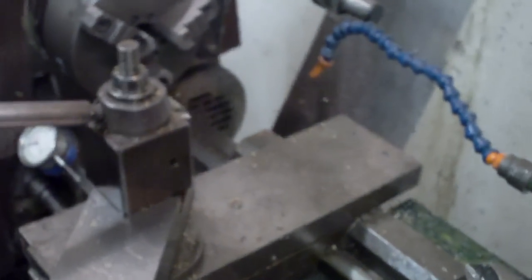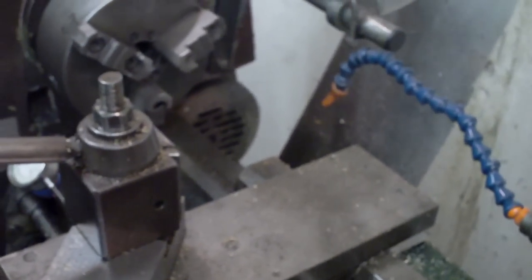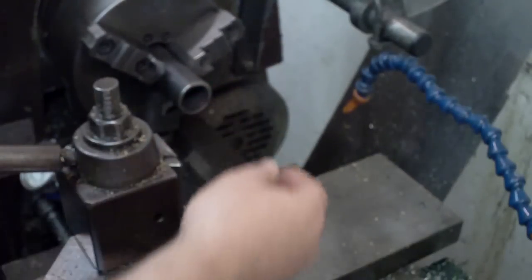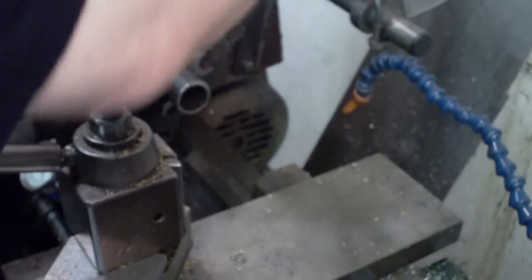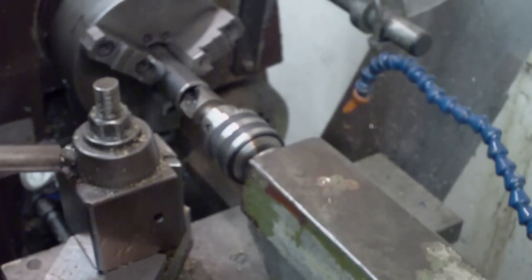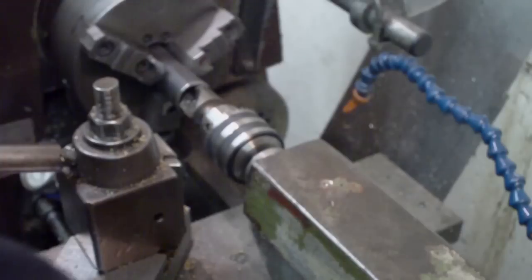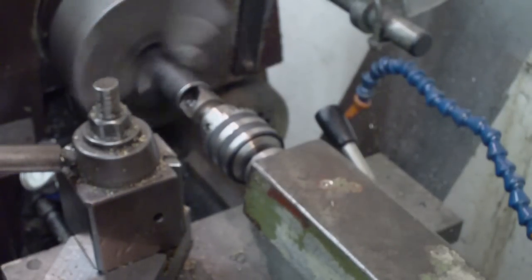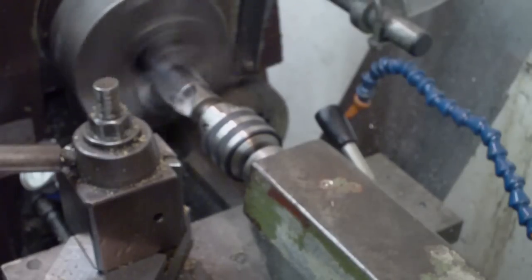I'm going to set the camera down — it's on a tripod. We're going to focus it on the chuck. Here's the one that doesn't have a chamfer in it. Stick it in the chuck. Bring your tail stock up, get it close like that, back it off a little bit, lock it down. Just a little touch of WD-40 on it — that'll smoke it. Here we go. Do the smoke — she's getting hot and she's cutting.